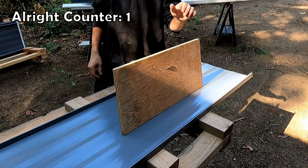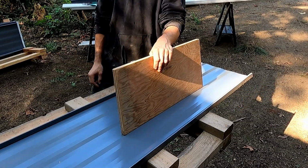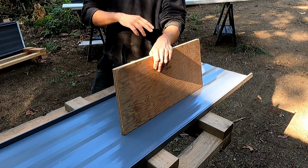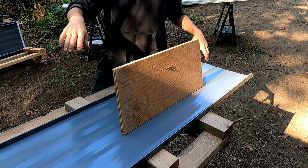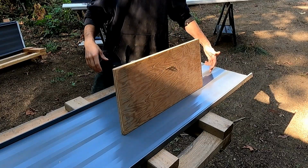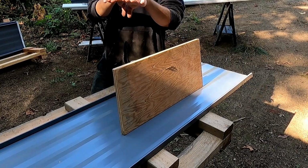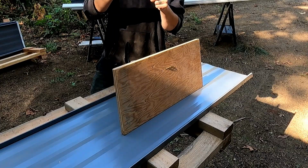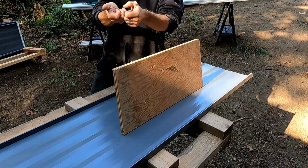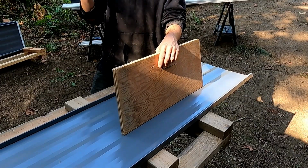All right. One of the things I identified last time around working with this steel roofing that was a huge pain was long straight cuts with the tin snips. My first and last panels on the roof are half panels, which means I needed to get a straight cut, full 14 feet of a panel. And the steel doesn't flex out of the way like paper does when you're cutting it with scissors. And I ended up having to cut a half inch strip out and do two parallel cuts and back and forth with the right and left-handed snips. Anyway, it was a pain.